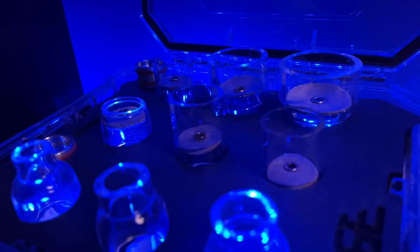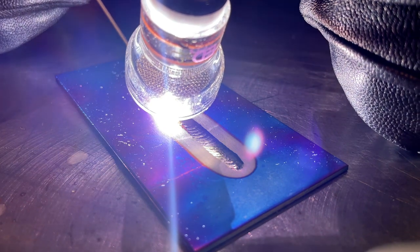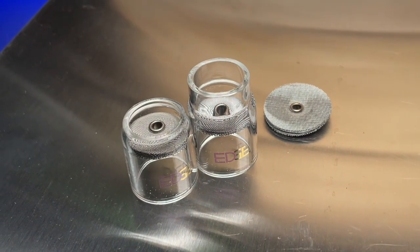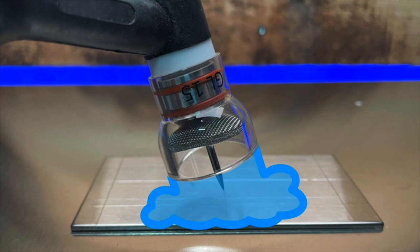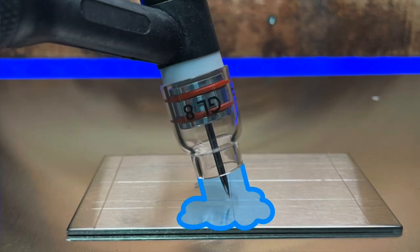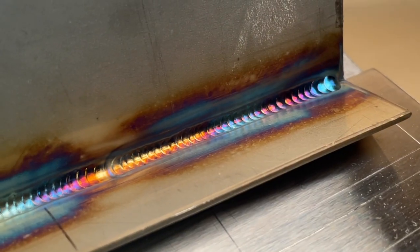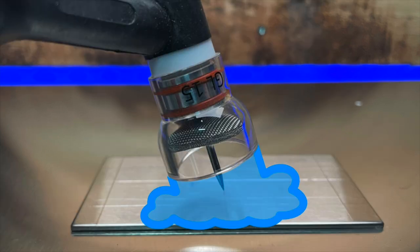Here's where I think I can get some unique results. I have some amazing cups made by Edge Welding Supply — these are built to deliver an extremely high volume of gas in the smoothest manner possible over a broad welding area, designed to give you the best coverage possible if you want to eliminate any oxide at all. To get some good colors, I'm actually going to use a number eight or number ten cup — something a little smaller. As shown in this diagram, a number 15 cup delivers a higher volume of gas and covers a broader welding zone, whereas switching to a number eight cup delivers gas to a much narrower, more specific area. We're still getting the proper volume of gas, just to a smaller area.